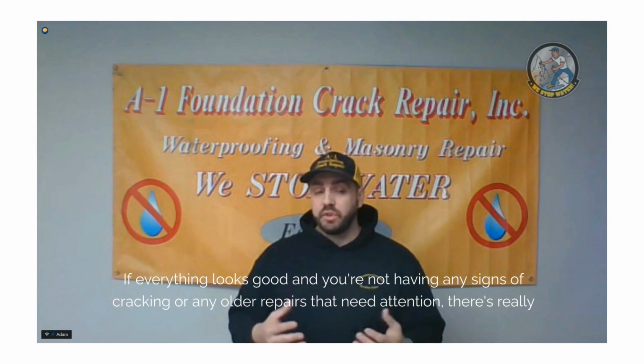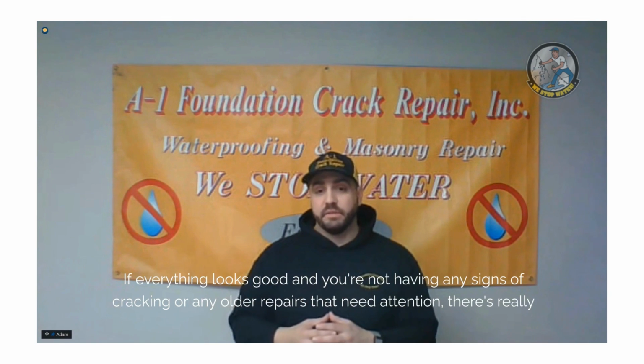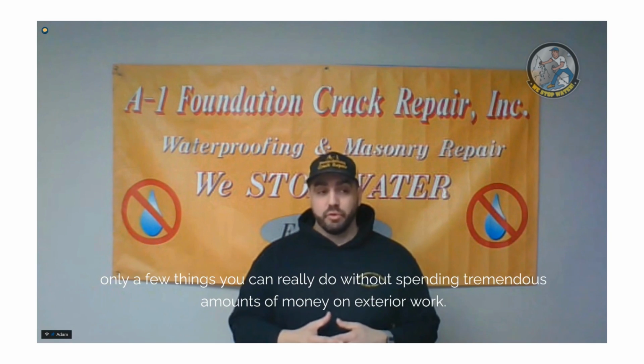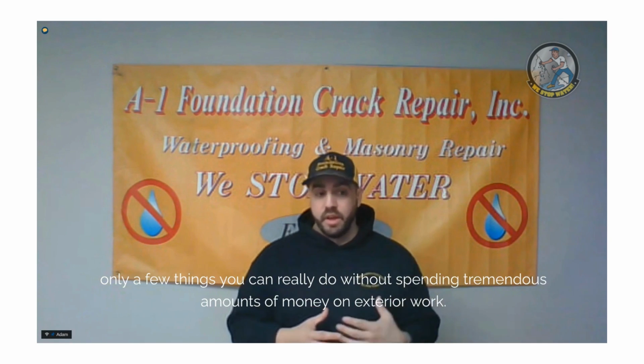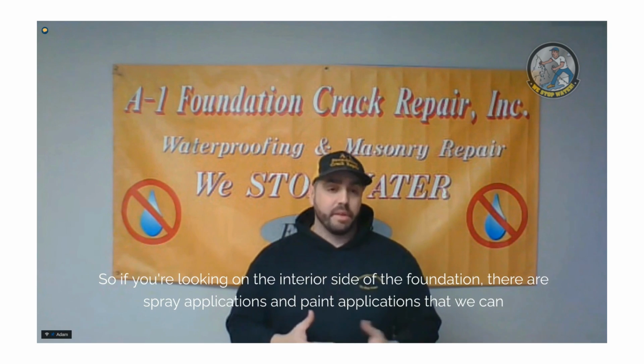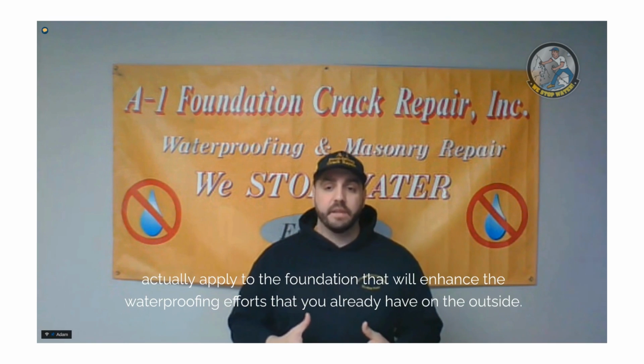If everything looks good and you're not having any signs of cracking or any older repairs that need attention, there are really only a few things you can do without spending tremendous amounts of money on exterior work. On the interior side of the foundation, there are spray and paint applications that we can apply that will enhance the waterproofing efforts you already have on the outside.